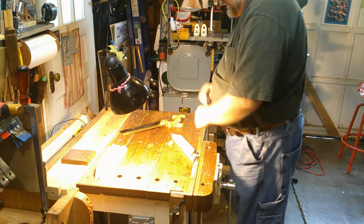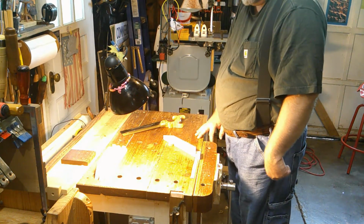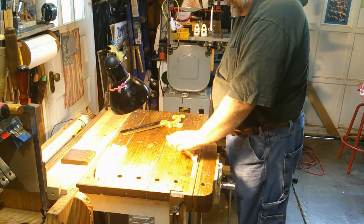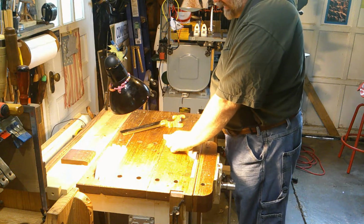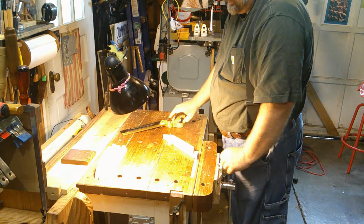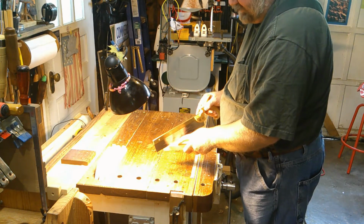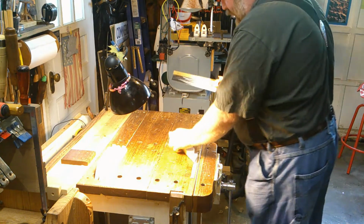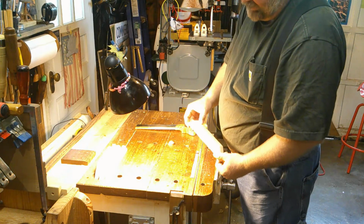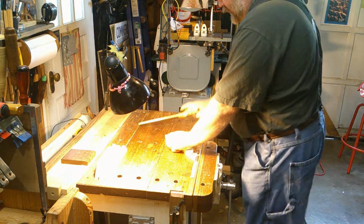So I put a peg in here because these cuts are angled in such a way. A standard bench hook isn't going to work because it's at 90 degrees. But this here will give you something to hold up against with your hand, and as your saw pushes against it, it'll move like this. But our knife wall was cut and made, and this should lay right in that for that initial cut. So, and we don't go very deep, we just go to this depth right here. This side won't matter much because this is waste material over here, or will be wasted out. So, alright.